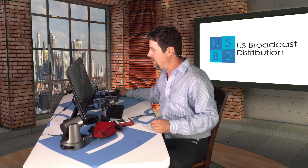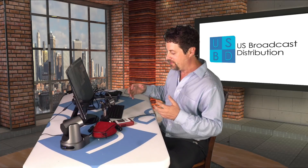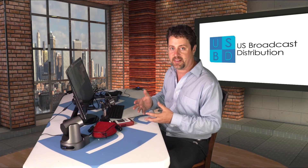Let's take a look at the unit itself streaming. We can see that it's running at about 600 kilobits per second, connected to three different antennas. It's running at about 30 frames per second and we're bringing in a signal which is 59.94 interlaced and it's live — sending the video signal out through three different networks and reintegrating them.